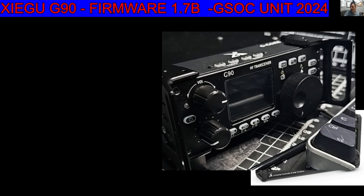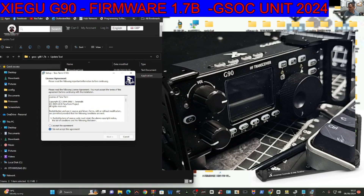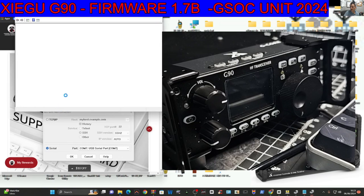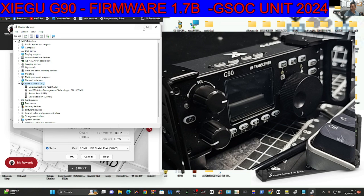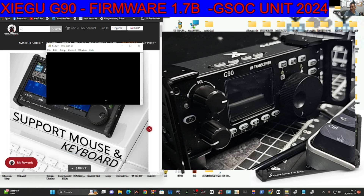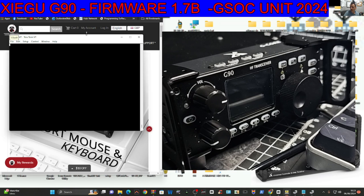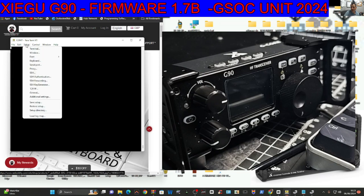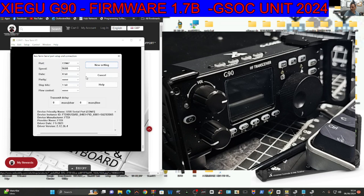Double-click where it says Update Tool and you'll get the program called Tera Term. Double-click and run it — just follow through Next, Next, Next and you'll get a window. It's actually two windows; select the bottom one where it says Serial, then go to the Communication Port. Select USB COM 7 (the port we talked about earlier) and click OK. Then right-click Device Manager, Ports, and confirm port 7. Remember we changed the speed to 115200. Click OK and you get the big black window.